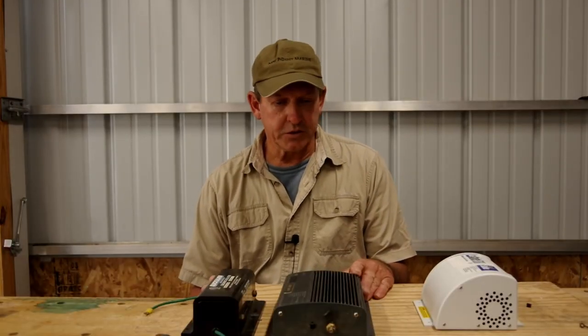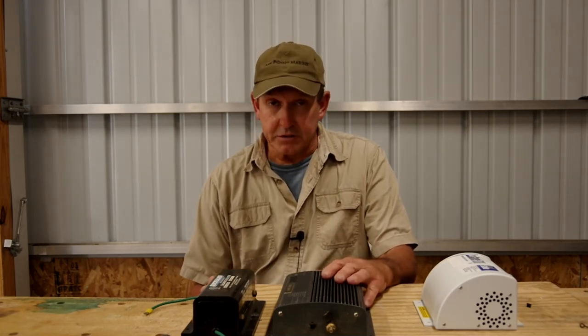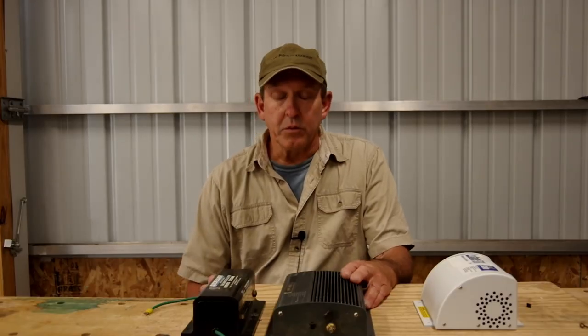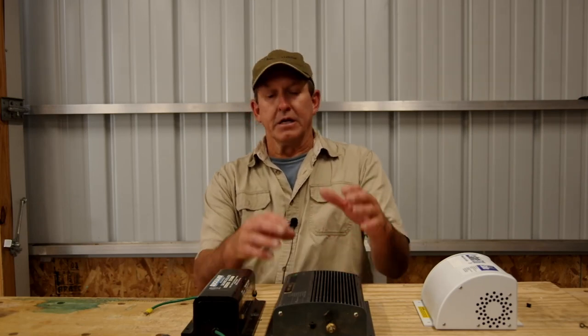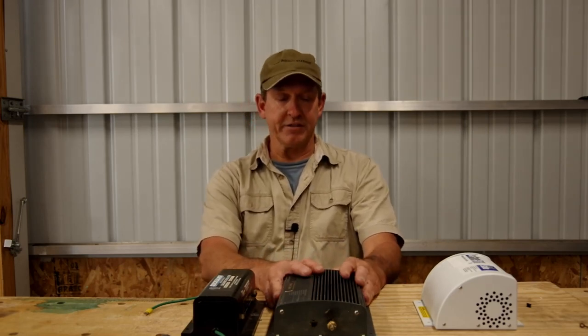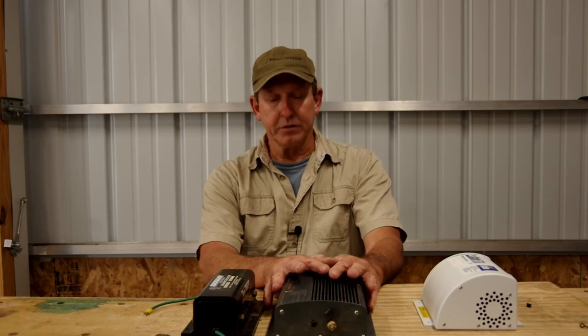So we've decided we're going to either install a galvanic isolator or replace an existing one on our boat. The first thing to consider is amperage — specifically the amperage of the shore cord. If you have a single 30-amp shore cord on board, you need to have at least a 30-amp galvanic isolator. These devices are installed in series in the AC safety ground, so they need to be designed to handle the full fault current of the shore cord. A 30-amp cord needs at least a 30-amp isolator; a 50-amp cord needs at least a 50-amp isolator.